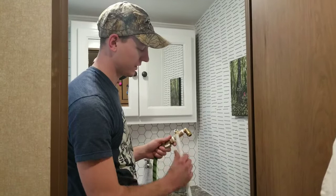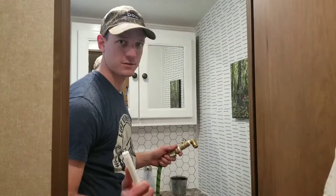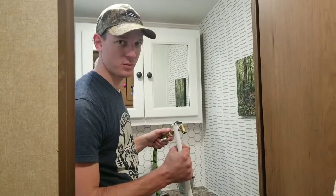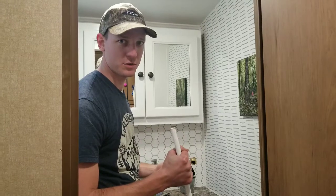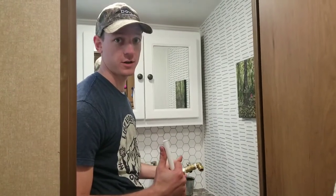The whole point of this is that I can buy this $3 piece of PEX pipe — it's a five-foot piece of half-inch PEX. This is a SharkBite fitting, so I can just plug it in there. When I'm done with it, I can just throw it away — one-time use. Buy a new one, and it only cost me about $3 to unclog my tank.